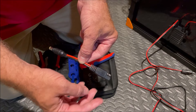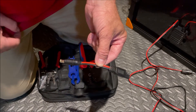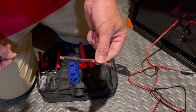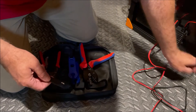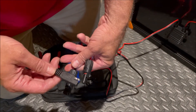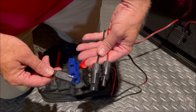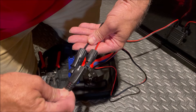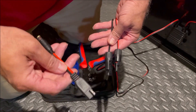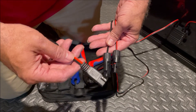The Harbor Freight briefcase solar panel comes with this adapter which goes from SAE to 8mm to plug into your Jackery's and other solar controllers. But since we have now converted our panel to MC4, we can no longer connect this, so we're going to have to convert this adapter to MC4 as well.